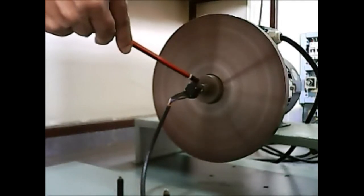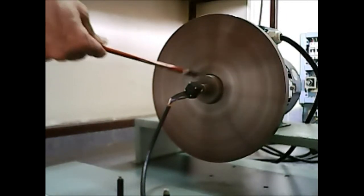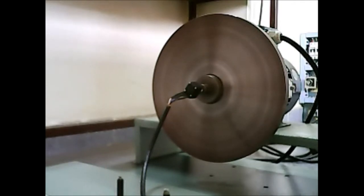The sensor used for measurement of speed is a rotary encoder which precisely logs speed data and sends 128 pulses for every revolution of the shaft. This encoder is a very small device, as you can see here. This sensor is mounted on the motor's shaft by a very simple attachment which holds the sensor firmly. This encoder holder maintains the encoder stationary throughout its operation while the motor starts from its original 0 speed position to its continuing run at full speed.